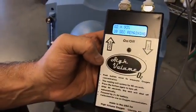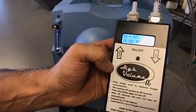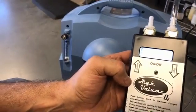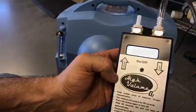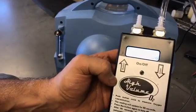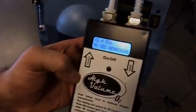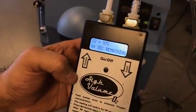The manual also says something about the liter-per-minute flow rate. There is a sweet spot — I believe it's between about seven to nine liters per minute where purity is supposed to be highest, but you'll have to look it up. We're getting 93% at nine and a half right now, and that's really good.